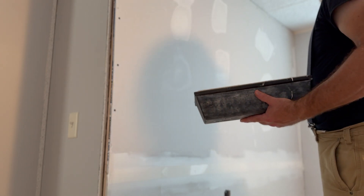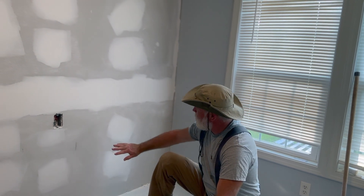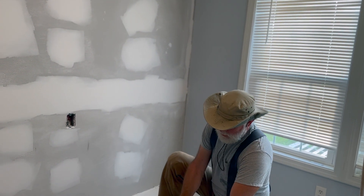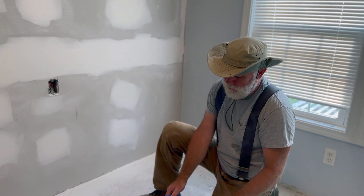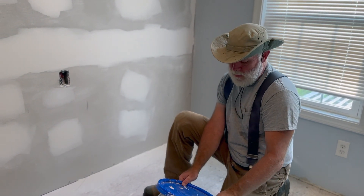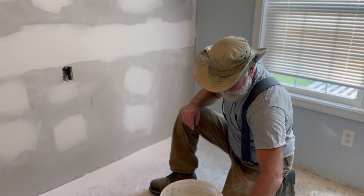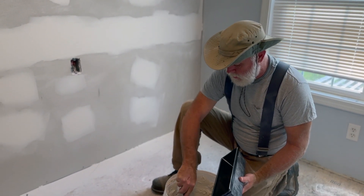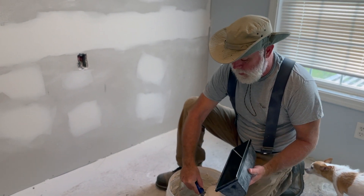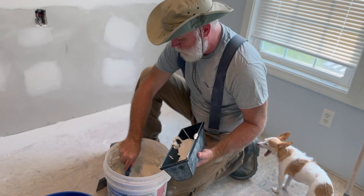So that's pretty much it for level one. We got level three mud put on the wall last night. I just got through sanding this down to make sure there are no rough edges, and now it's time for the level four. I've never done this before, so this is kind of an experiment. I've been playing with mud enough that I'm hoping I can get a nice smooth finish so that it will match the paint that's on the vinyl that we already have on the other walls. If you're working with a brand new box of mud or one that's a little bit old and stiff, you might want to throw the drill in and give it a good stir.